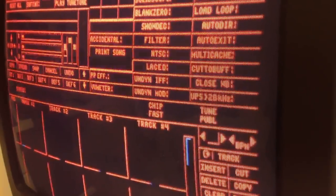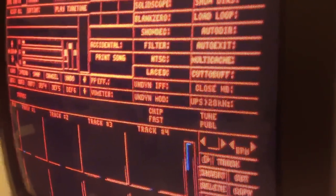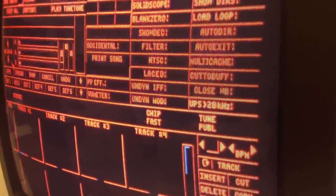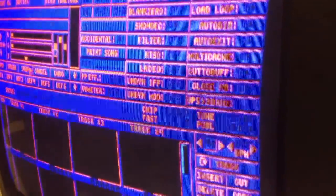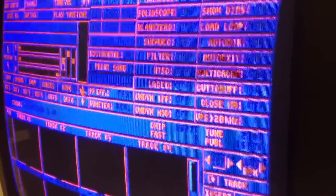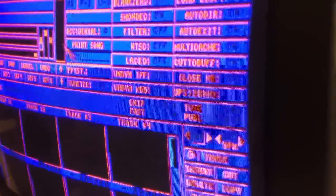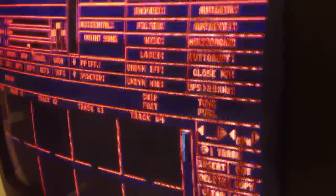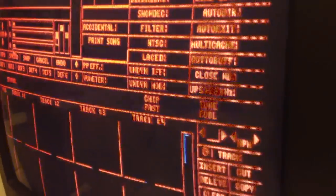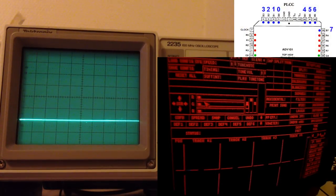So what can we expect to see on the scope while probing those 8 pins? Well, not much, not while the screen is like this anyway, because there isn't much blue on the screen, so all those 8 data bits will be turned off. I will have to move the slide bar a bit to the right, and if I move it to the furthermost right position, I expect all data bits to be turned on. Then I can just probe them all if I want to. But I can also move the slide bar back and forth like this while probing the pins on the video DAC for the blue color, and I should be able to see the data bits turn off and on while I'm moving the slide bar. Okay, so I will start with B3 here. Let's see what happens when I move the slide bar.